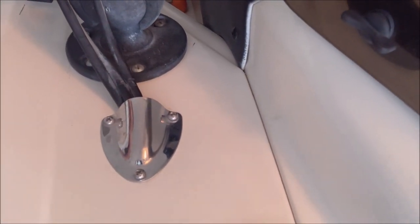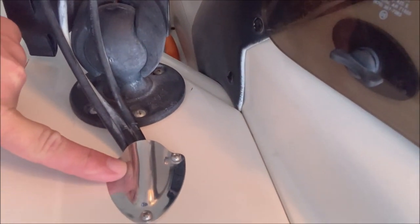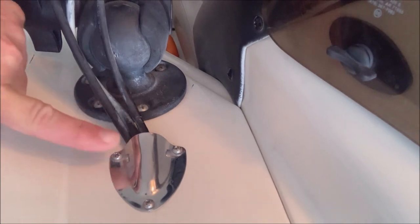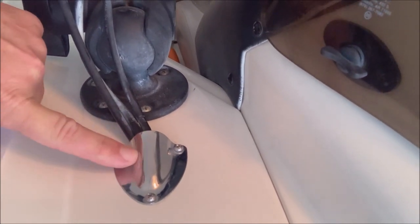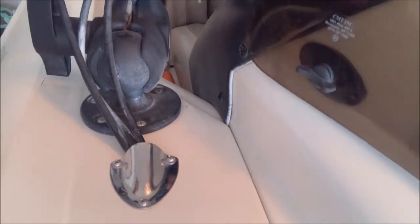You don't want to put a small hole in and run the transducer wire but then not be able to run the power cable or network cable. The next tip is to make sure you use a good clamshell — stainless steel — to cover up the holes. I drilled the hole with a good quality hole saw, made sure it was big enough for three wires, and then used a clamshell to cover it up. These aren't that expensive but they make the job look a lot better. Use one at the entry point and another at the exit point on the back of the boat.